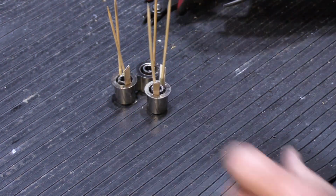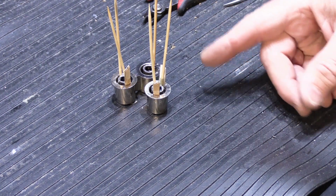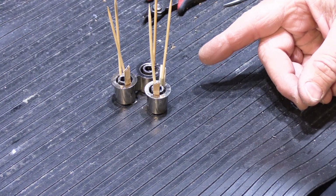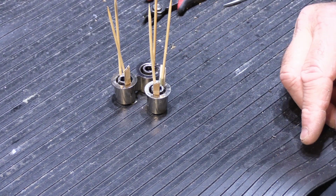Now, the last bit is, if you do all of this, and you don't do something about the control shafts that are too hard to turn, guess what's going to happen? These are just going to break again. So you have to deal with the control shafts that are hard to turn. But that's a topic for another video, because this video is about fixing knobs. But look for a control cleaning video soon.